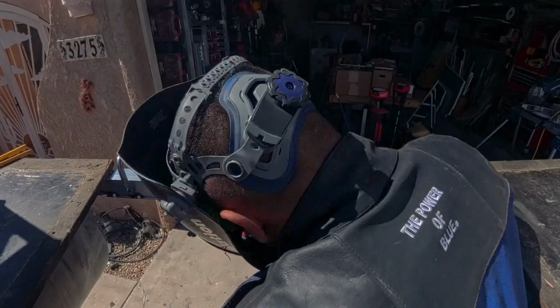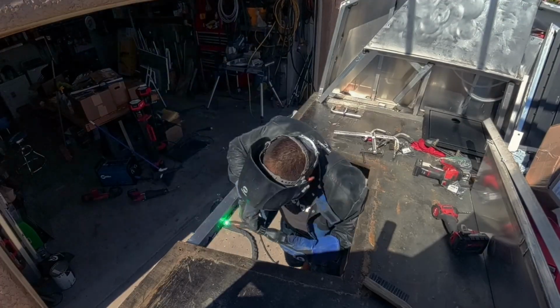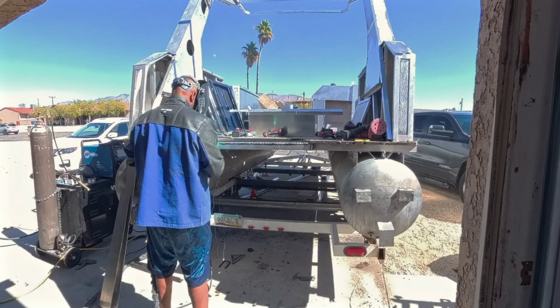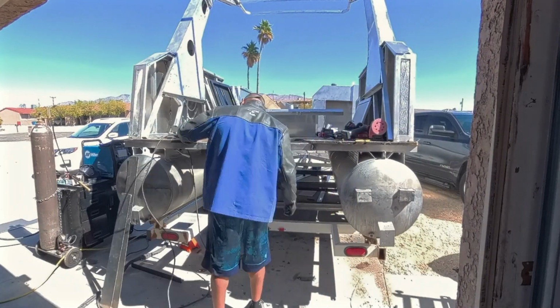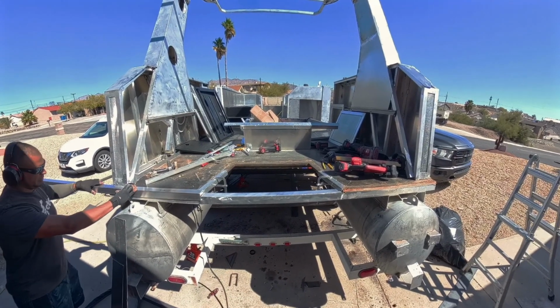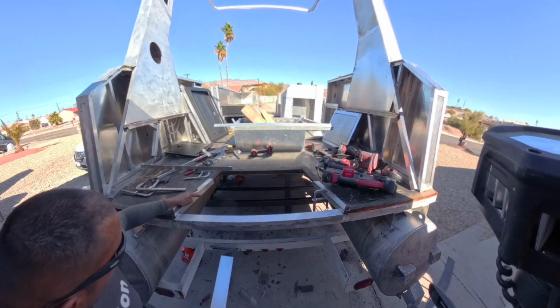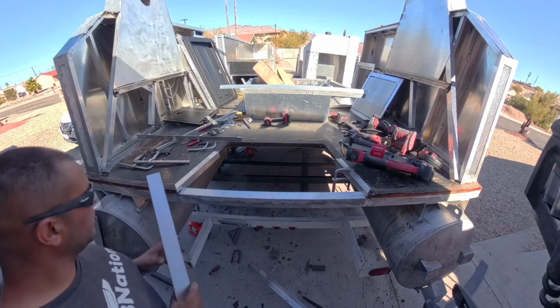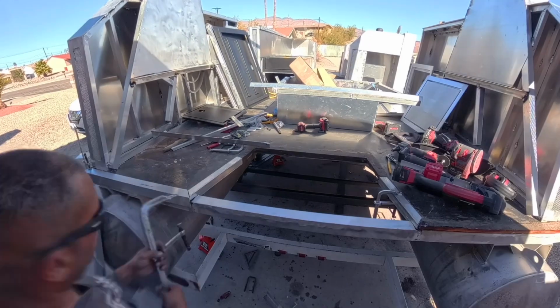So we just had to enclose that tube with angle to make an outer tube, so to speak. There's a lot of extra welding and cosmetic work. Now we have to replace the edge trimming with something that's going to match the rest of the boat's design. So we trimmed that wood and re-preserved it with epoxy, and then started in on our initial design, which just consists of angle every so often, moving around, which we'll try to weld without causing a fire on the wood.